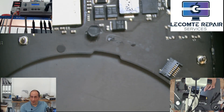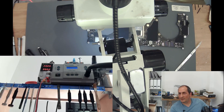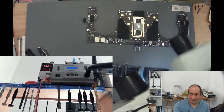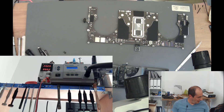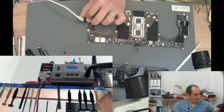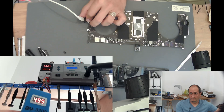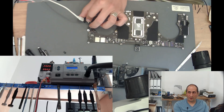Now let's look at what happens when I try to power this board. Let's turn on the power supply. I'm going to connect this here first on the left side — it keeps falling down, it's broken and doesn't hold anymore. Look at what happens: we're boosting to 20 volts and we're getting 230 milliamps, which is the normal current for this board when there is no battery connected.